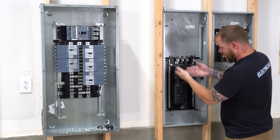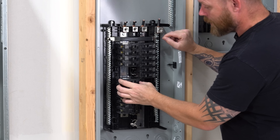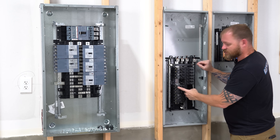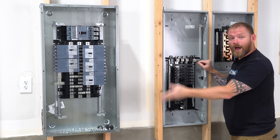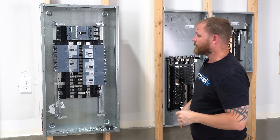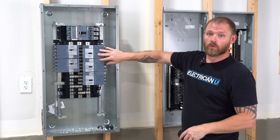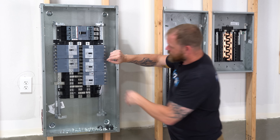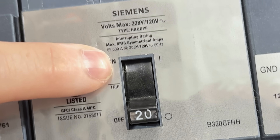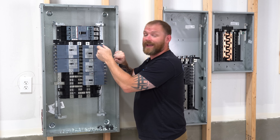In little MCBs, you can get larger interrupting ratings — breakers that are typically a little bit larger in body. They look very similar but have a different rating stamped on, meaning a higher available fault current or higher interrupting rating that it can withstand. With these larger MCCBs, they're much larger, so we have a lot more threshold in our AIC rating. This one is rated for 65,000 amps — that's six times the amount of current that can flow without this thing actually being damaged.